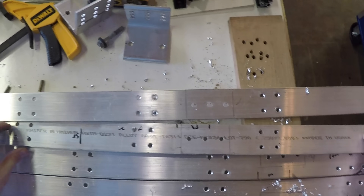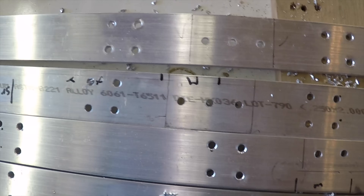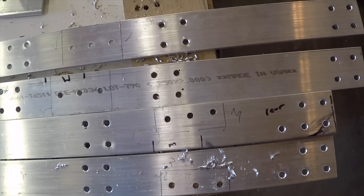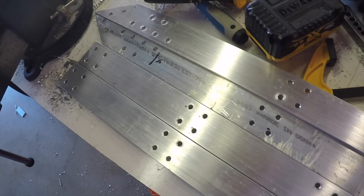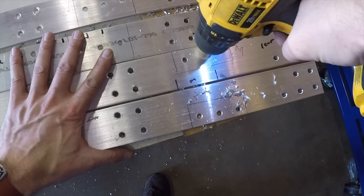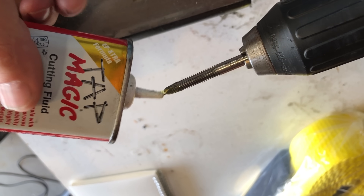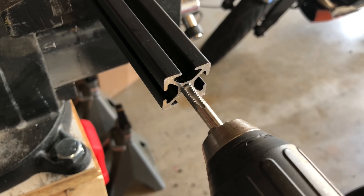Now we build. This project requires a buttload of drilling. We didn't spend a thousand dollars to buy this — we're spending three hundred to build it, which means we saved seven hundred dollars, so feel free to buy yourself a nice drill. I used a drill guide to drill straight and drill multiple pieces at once to save time. Be sure to deburr your holes when you're done. If you were too cheap to buy the pre-tapped extrusion, now is the time to get comfortable and tap 40 holes. Do yourself a favor — chuck the tap in a drill and get some tap oil.